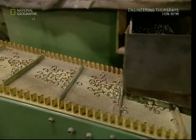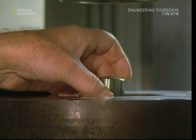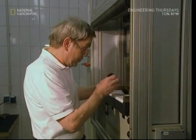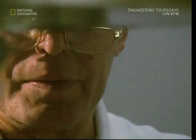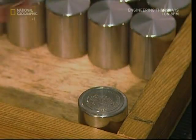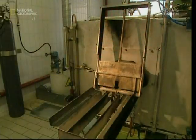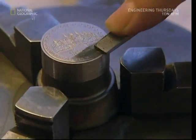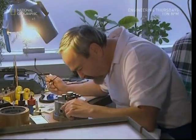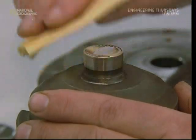So we've got our outer rings and we've already made up the fillings, but there's still something missing. All of our pieces are blank bits of metal — a template is needed to turn them into coins. The engraver's job is to make the coin equivalent of a rubber stamp, which permanently marks the value onto the coin. Using an industrial press, he crushes a pattern onto the stamp block, exerting 160 tons of pressure, so he's got to be very careful. The stamps are hardened in a furnace at 870 degrees Celsius — without this treatment, the motif would disappear very quickly. But once it's been hardened, each stamp can engrave as many as 200,000 coins. The surfaces are scraped clean using fine glass to remove any imperfections, then checked and polished before being put to work.